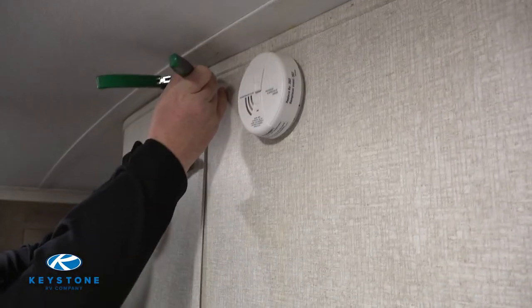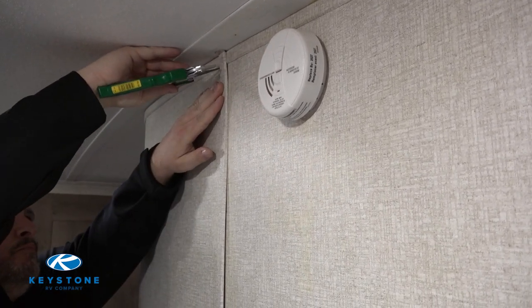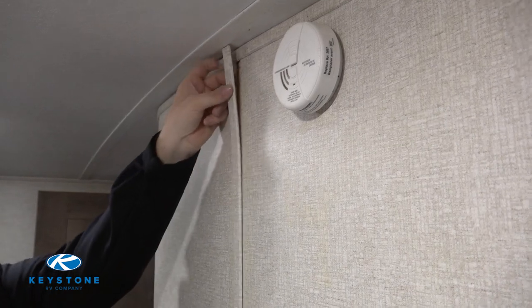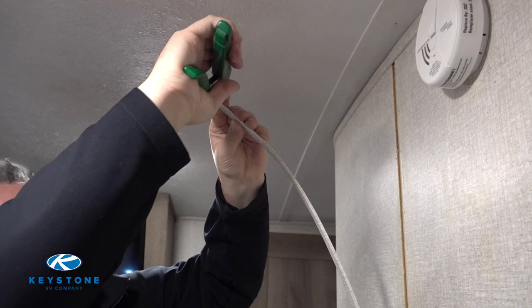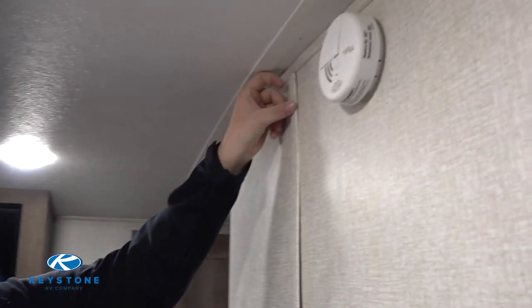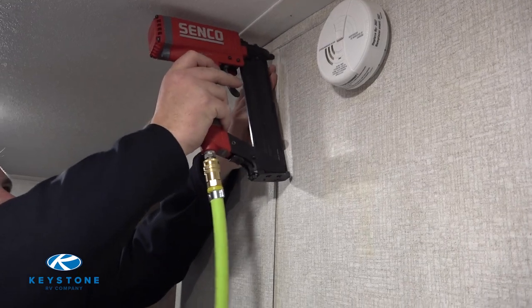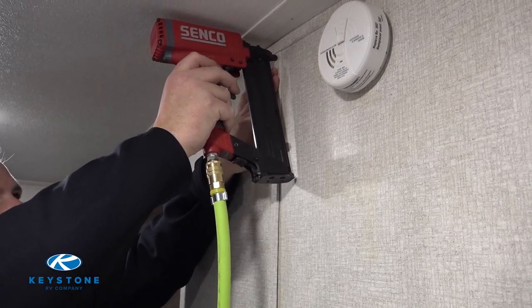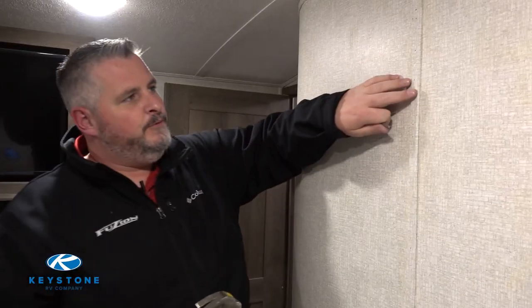Once you've reached this point, you'll need to trim the top to make sure it fits under the other flat trim. With the trim flat to the wall, use your trim shears to mark where the trim should lay. Place the trim shears horizontal and cut the excess material off. It is a good idea to cut a little long the first time to be sure of a good fit. Then use your pin nailer to finish attaching the trim, spacing the pin nails eight to ten inches apart.